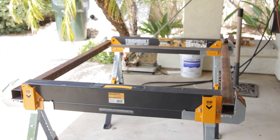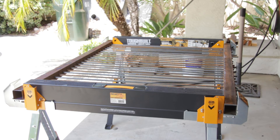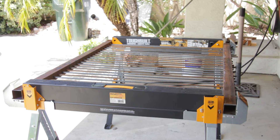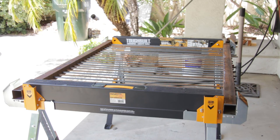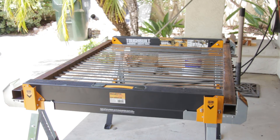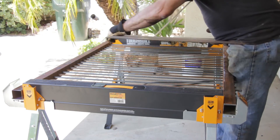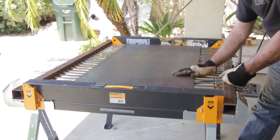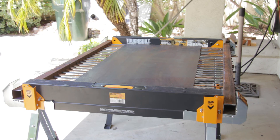As you can see, I have the rebar all the way through now. We have the portable sawhorse stands, two by two channels on each side tightened down on the sawhorses, and 25 pieces of 40-inch, 3/8-inch rebar going through both channels. Now I can either place metal crossways this way, or place a 48-inch sheet on the rebar and come in and plasma cut.